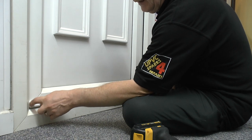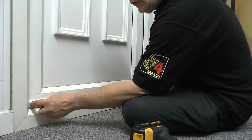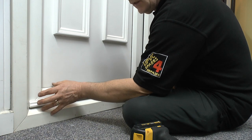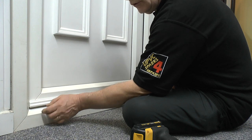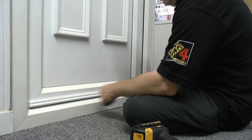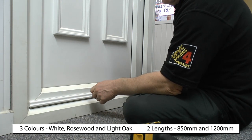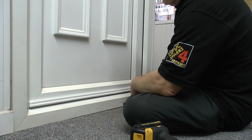Just to safeguard it, you can open the door, pull the cap off once more, and put a small amount of superglue at the back so that it adheres the drip bar to the door. Just be careful — keep the door open slightly once you've done that, because if you've got any drips of superglue below you'll suddenly find that the door is stuck closed — not a good finish to the job! That's it — it's available in a white finish, we also have the rosewood finish, the darker one, and we've also got the light oak finish as well. All available through UPVC Spares for Repairs. Thank you.